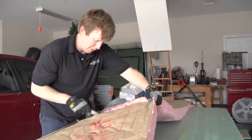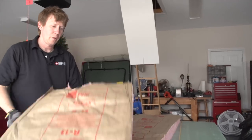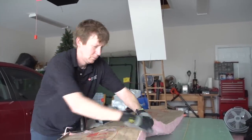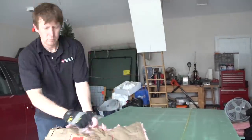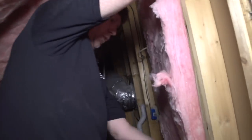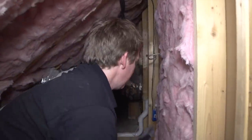They make a longer knife that actually works a little better, but this is good enough. I'm going to need four pieces, so we're going to cut three more. Now we're going to put some fiberglass in the hole here. We use R13 anytime we're working with two-by-fours because that's about the most you can get in there.